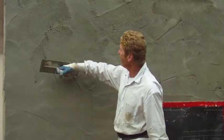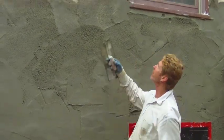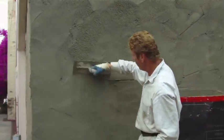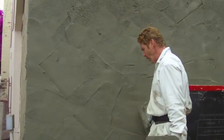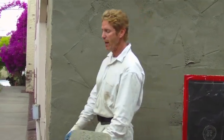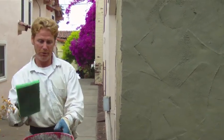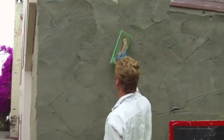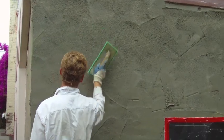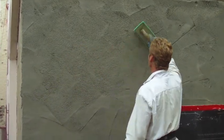Okay guys, we are done with the second coat. Now what we're doing is putting indentations. If I use a straight edge or Darby, I'll have a perfectly straight wall — but they have a lot of indentations. So we're just using our trowel now, making them just like that. You want the indentation — we don't want a perfect finish. I'm going to grab a float and we're going to go upward, going every different way. Just go one direction — it's not going to match otherwise. I'm pushing it in here and there.